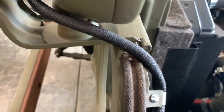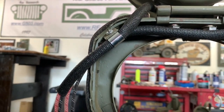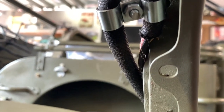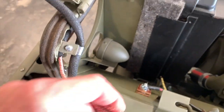You can kind of get your fingers in there, or use a socket or a small tool, to make it easy. We've also got a clip here, and I want to show you this because it's the specific thing I was talking about earlier. We've got two of those number six clips butterflied — placed together — to hold those two wires in place. I'll bring the camera around from the underneath side and show you exactly what I mean. I've got one laid on top of the other, then the head of the bolt is inserted from the top side of the bracket, then a lock washer and nut, tighten that down, and that holds those two wires right in place.